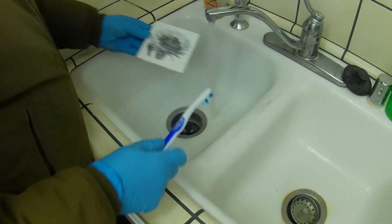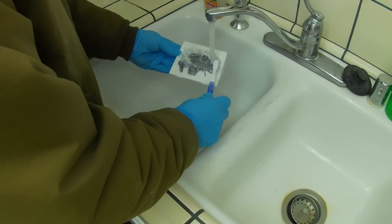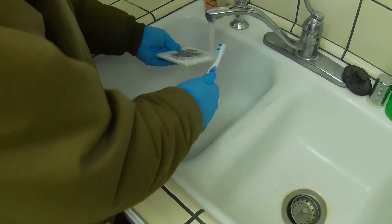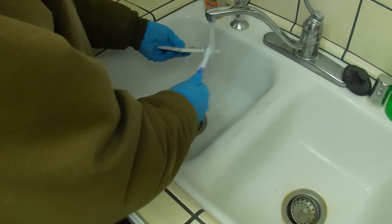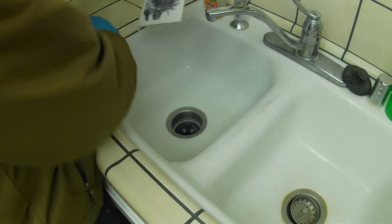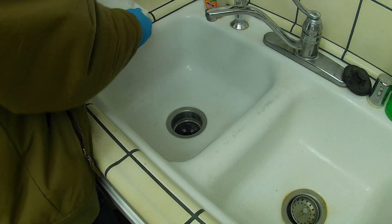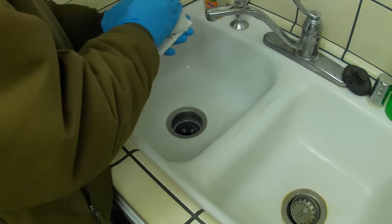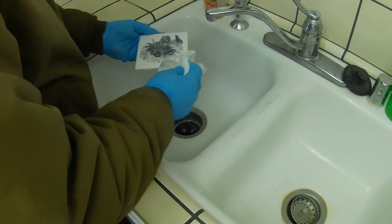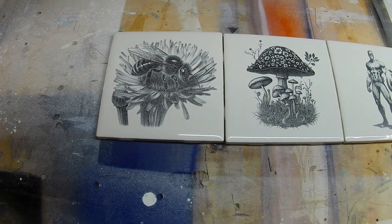After you've engraved it, you're going to need to clean it off. This is why I'm never going back to the paint system ever again — it's simple. Just rinse it, get yourself a little toothbrush, lightly go over it. Very simple, very easy, no toxic anything. That said, titanium dioxide powder does have its own drawbacks: if you touch it, it gets on everything, and when you spray it the powder can be in the air. I wear a mask and I recommend you wear a mask too. It's not any worse than the chemicals in spray paint, though.